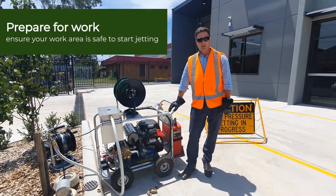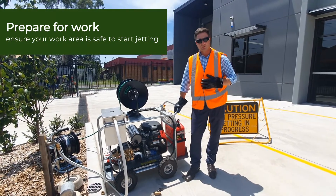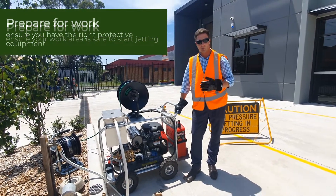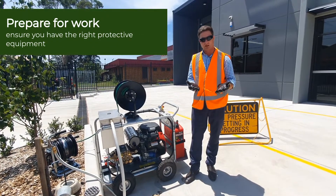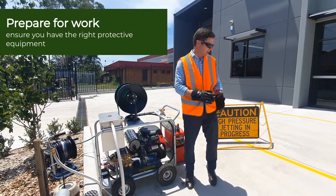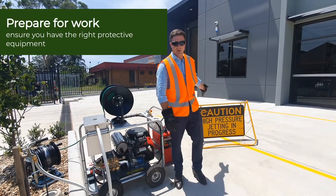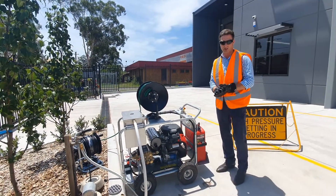The first thing you do when setting up for your water jetting machine is to make sure you've got suitable protective clothing on, which means eyewear. I've got some Kevlar-rated high pressure cleaning gloves here. There is also a Kevlar apron that you can get out of your Class B safety package, and you make sure you've got adequate pedestrian warning signs before you go to your drain and clear the choke.